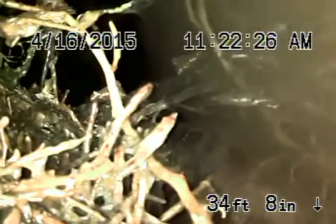Now you can see there's a very large root here. This is the cast iron to clay connection where the pipe exits the building, about two feet deep. There's green paint there on the outside. You can see it's totally packed with roots.